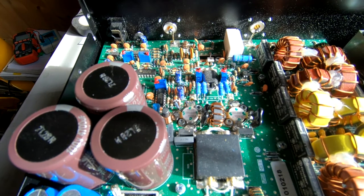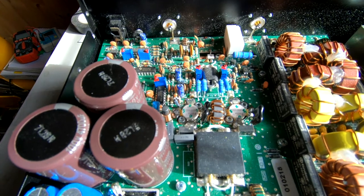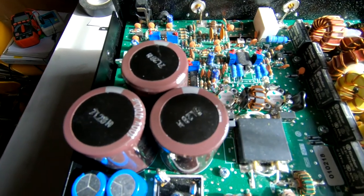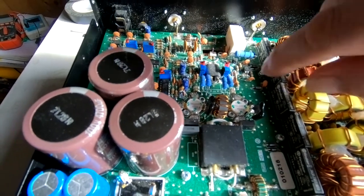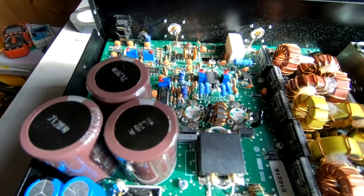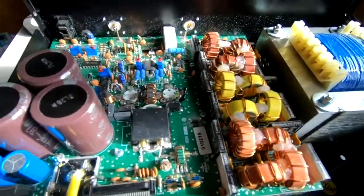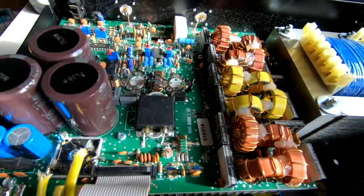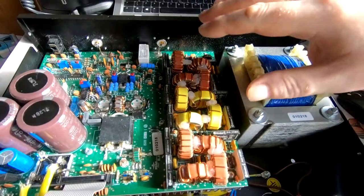So I've got plenty of time to work on this one. This video is going to be a couple of parts. I've done a full inspection of all the components - checked all the caps for cracks, checked all the resistors for burning, checked the semiconductors for signs of burning, and checked the electrolytics for bulging tops. Before powering it up I wanted to disconnect the two main output FETs just in case there was an issue - I don't want it going up in another puff of smoke.